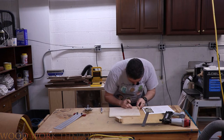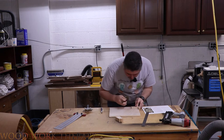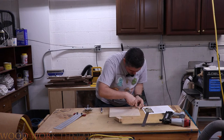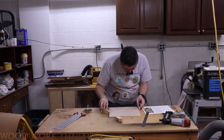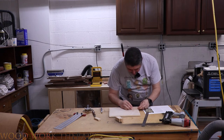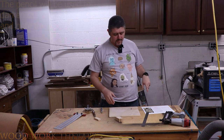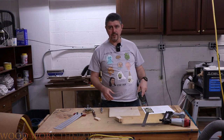Using another block to guide the ruler, we very carefully come in and draw the line. Now we put a little bit of glue on the back and line it right up with the mark. And there we go — we've got our 25-degree angle block, which works out really well. We'll go ahead and set up the rest of these and show the gluing process.